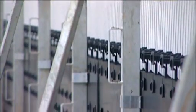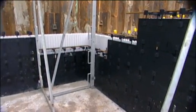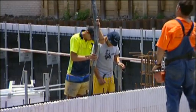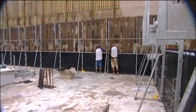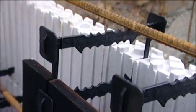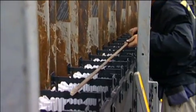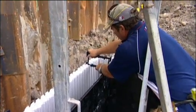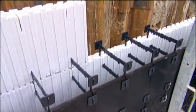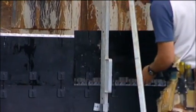Consisting of a certified design registered wall brace scaffolding system, the walls are held in place for accurate construction and safe access to assemble and pour the concrete. The wall brace scaffolding also has handrail loops for installation of 100x50 timber handrails. Recycled plastic interconnects separate the panels and support the reinforcement steel accurately with the correct concrete cover, and are available in different widths to cast concrete thicknesses as specified by the structural engineer. The reform panels locate for perfect alignment in a stretcher bond format.